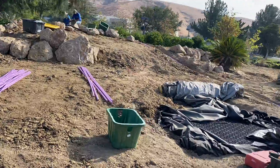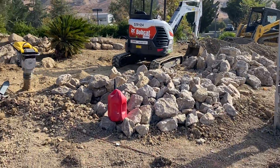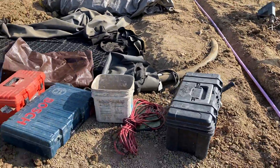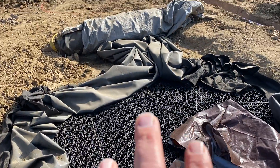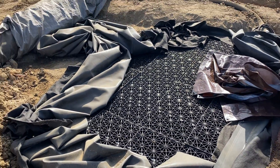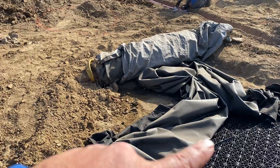This is a 20-ton stone and we've got another 20-ton coming in a couple days — we'll use that for the interior water feature. There's our electrical and we have an autofill already in. We overbuild our boxes — this is twice as big as it needs to be, but that's how I roll. I like to have protection so that if the client expands the project, you're super good. This is a 120-foot by 80-foot liner.